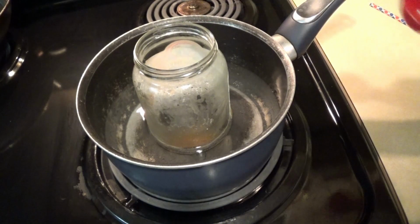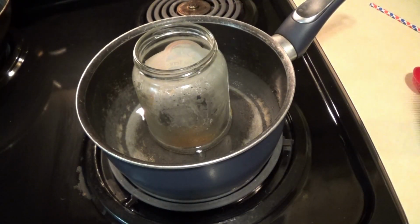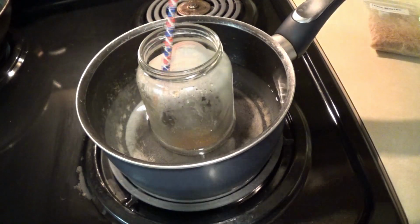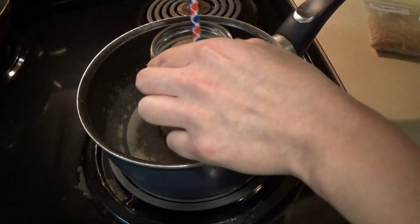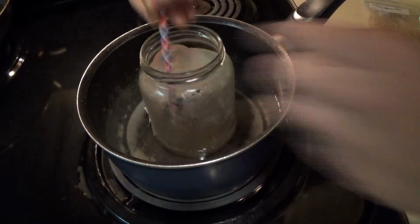And you want to make sure you mix thoroughly. Mix every 1 minute. And you do not want to go past 140 degrees Fahrenheit. You want to stay below that. If you go past 140 degrees, then your hide glue is going to start losing its strength and it'll start hardening up really fast. And you do not have a lot of time to do this.